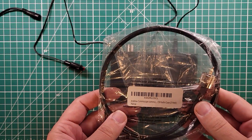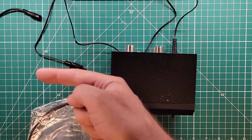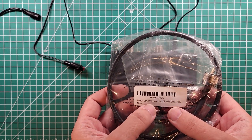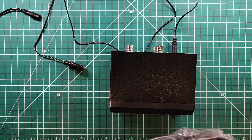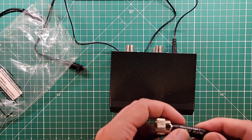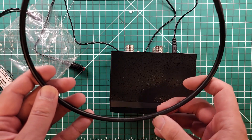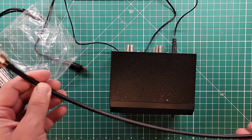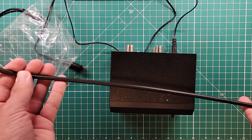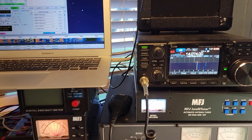One of the things that I'm going to need is another piece of coax to go from the radio to this, because this already goes out to the antenna system. This is the Andrew Comscope CB radio coax, two feet, with crimped ends. This is CNT-240 - a slightly more flexible version of LMR-240 if you're looking for a specs reference on it. There'll be a link for this in the description down below.